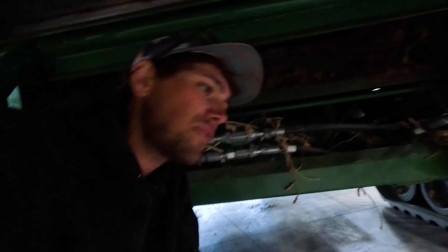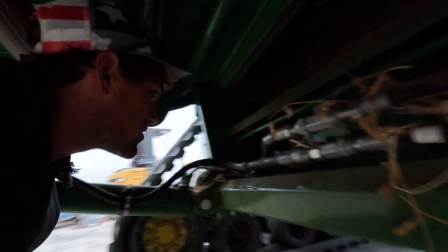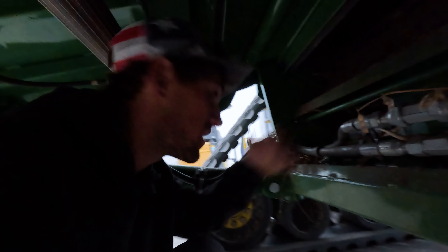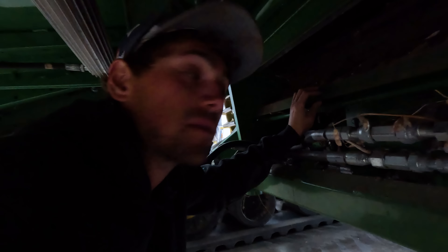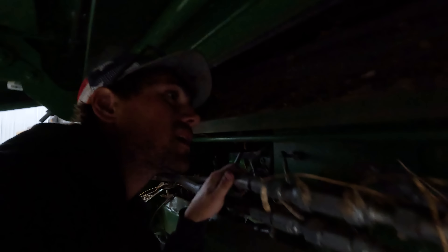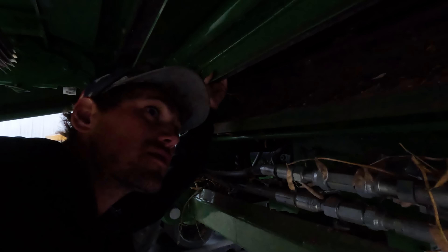Both corners split out. I was doing some headlands last night and got back to the main rows and I'm like, gosh, I'm missing 20 bushels — it went from 45 to 55 down to 35. Something's not right. Started diagnosing, throwing the pan behind the combine, thought maybe I was in some green stuff, thought something plugged, checked my sieve. I had zero losses behind the machine. Got home after combining maybe 10 acres like that — thank God that was it. We looked under here and there was a three-inch gap where loose beans were coming out.